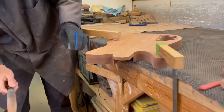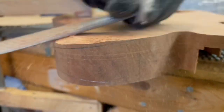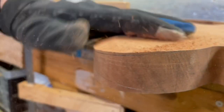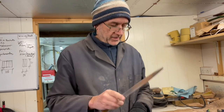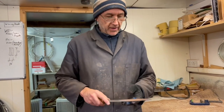I need to be very careful here because this line on the edge tapers up, so I really can't attack this too aggressively. The beauty of this rasp is that it's a handmade rasp rather than a machine-made rasp, which results in a slightly uneven pitch of the teeth. That might sound like a bad thing, but it's actually very good — rather than cutting the same way each time, which can create channels and tracks, it cuts slightly unevenly so you end up with a much smoother cut.